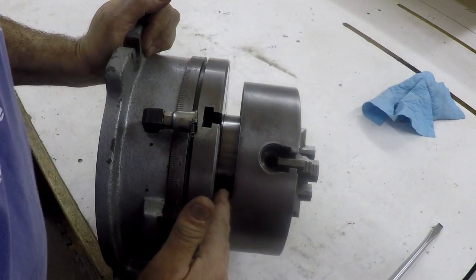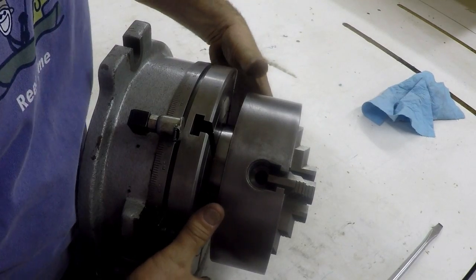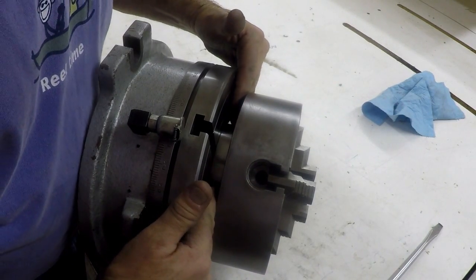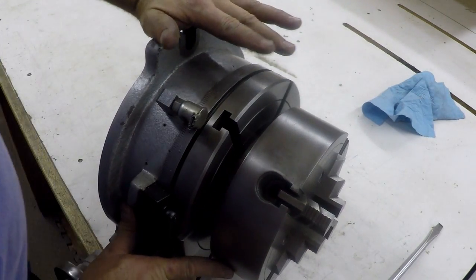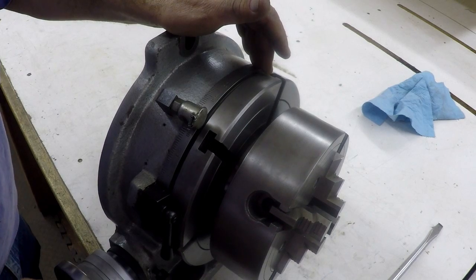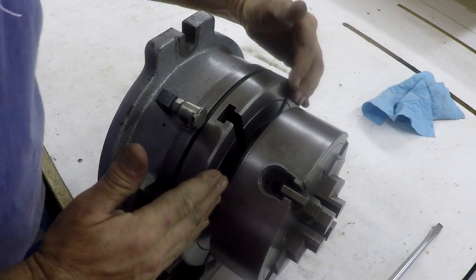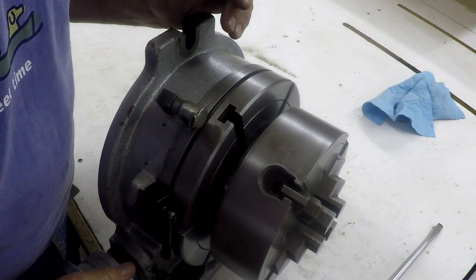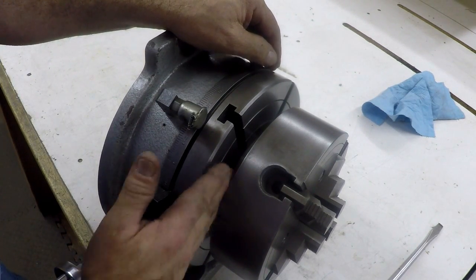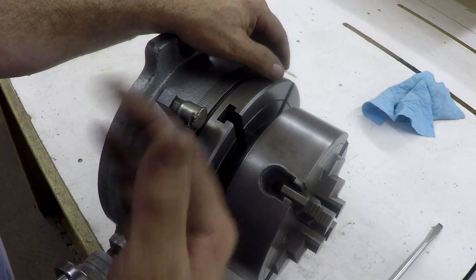I have a little over 3/4 of an inch gap here. I'm thinking maybe I can make some plates one of these days that I can mount on there and have an indexing something that indexes up here on top — kind of make it very similar to a super spacer that way. It does have the degree markings and all that, but you can make it so you have a quick indexing so you don't have to think about how many degrees. That's why I left it tall. That'd be an interesting project — I'd have to get some cut plates and then machine them with the notches.